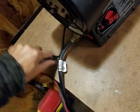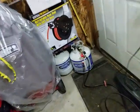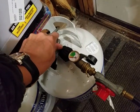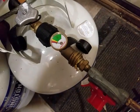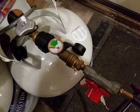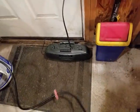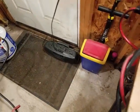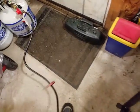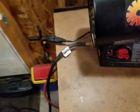I'm just having a hard time trying to do this with one hand. There we go. You can see the spark on the inside. It's constantly doing that. I'm going to turn the valve all the way on. You can see this is a full tank and the gauge hasn't moved yet. From what I've recognized in the past, once it starts flowing through — because it's really cold right now — the gauge will start going up. Also, because I keep this in the garage and the hose is really cold, I have to kind of bend and straighten the hose to make the propane flow through much easier all the way through.